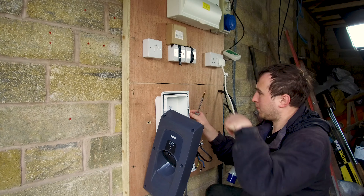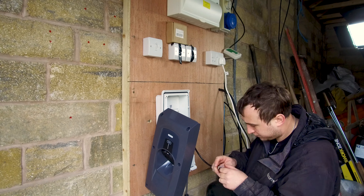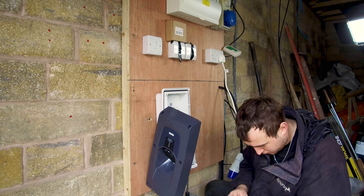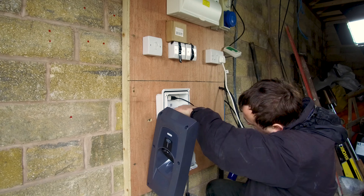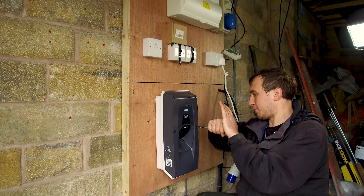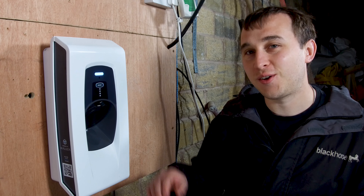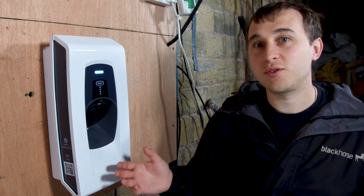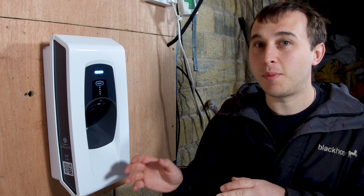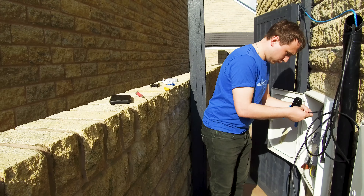Installing this unit was pretty easy. I opted for rear entry because they look nicer, but you can go for bottom entry if you prefer. There's a back bracket you install first, then you pull the cable through and hang the charger on the bracket, then tighten a couple of screws. They've also got torque screws to secure the charger to the rear bracket, stopping anyone pulling it off the wall. The bracket design is well hidden, and you're not screwing into the actual unit itself, which means you're not damaging any waterproof integrity. There are WAGO-style terminals for the electrical connections and punch-down tools for the CT clamp.